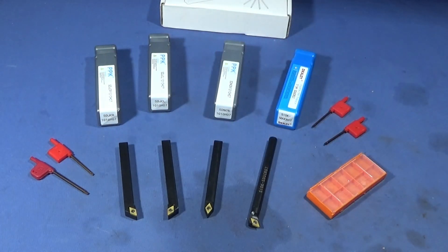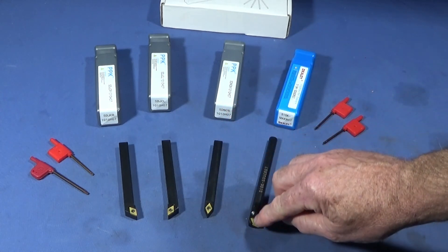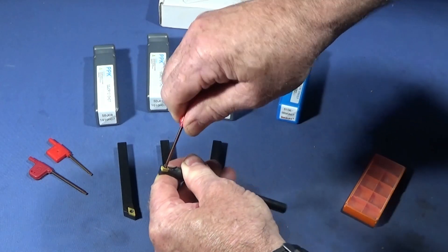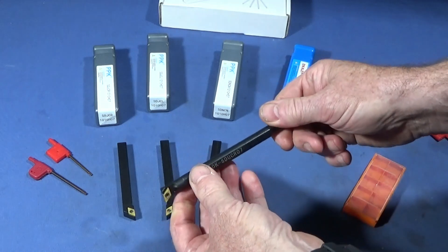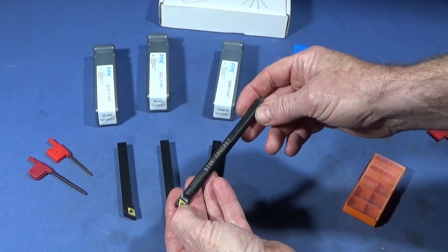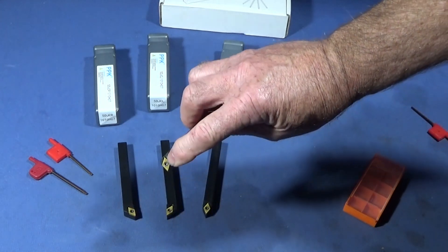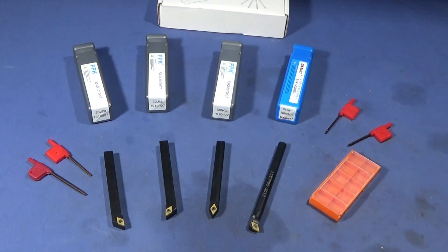The individual packaging for each tool also includes a key for each tool, and it comes with four inserts that you have to screw onto the tools. If you're new to insert tooling, there's no need to over-tighten these screws when you put the carbide insert on — just screw it down and give it a slight nip up. There's no need to over-tighten them or you'll find you can't get the screw out later. Also, when changing or fitting an insert, make sure you do it over a clean surface so you don't lose the tiny screw. If you do lose one, you can buy separate screws on the Banggood site.